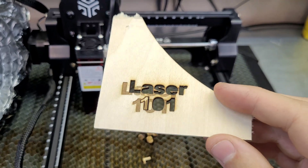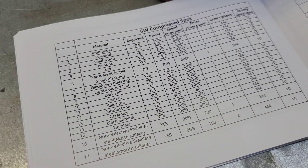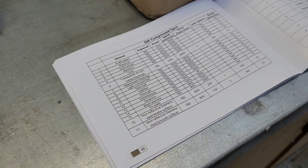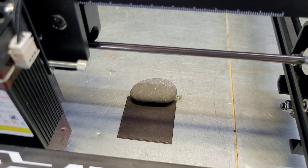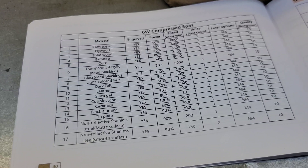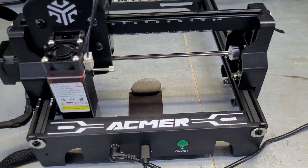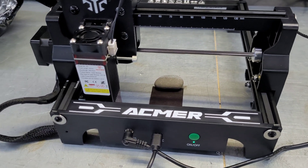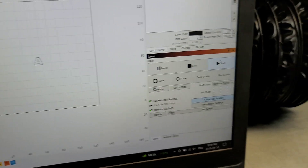As far as settings go, there's a pretty good list of materials you can engrave. For things like glass or stainless steel you often need to add an engraving spray or blackening spray. The Amazon page claims you can also engrave stone, so I have a small pebble here and we're going to give that a try. It's not listed in the materials list in the book but it does claim it's possible. I'm going to use the same settings I used to cut the wood — 125 mm/min at 100% power — and engrave just a quick letter A on it, then fill it in after.